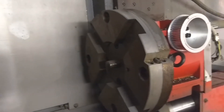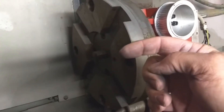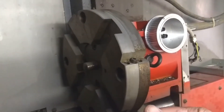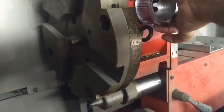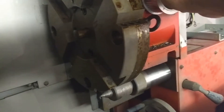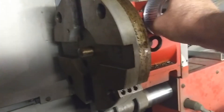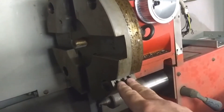A video on the turret operation - I thought it might have a solenoid or something to lock the turret, but it doesn't. This is a unidirectional turret, meaning it only rotates in one direction. The motor turns it in one direction, goes past the pawl, then reverses and locks it. Right there it's against the pawl. You probably heard it - the turret drops in. So there's a ramp in the back of the turret tool plate. The turret turns this direction, and then at a certain interval it comes back and locks against it. The tool pressure is against that pawl.